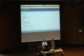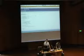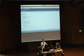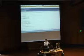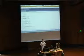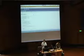What we're doing here is defining that we're going to be talking to the one-wire device on pin 13, and we're cheating a little bit. What we're doing is using one of the I/O lines as a power connection. And that's just because I was wanting to put it onto a 3-pin header, and there was no ground input and plus 5 volts in a row, so I'm using one of the output lines as a power supply.